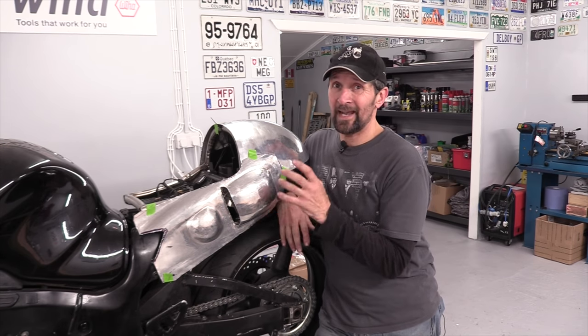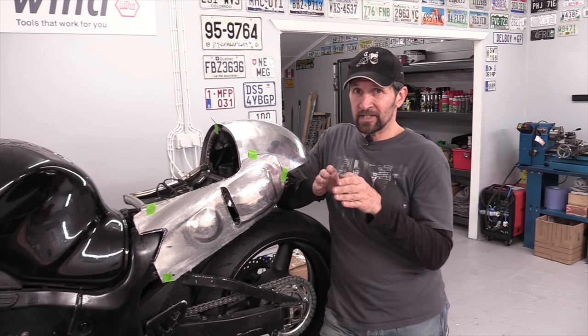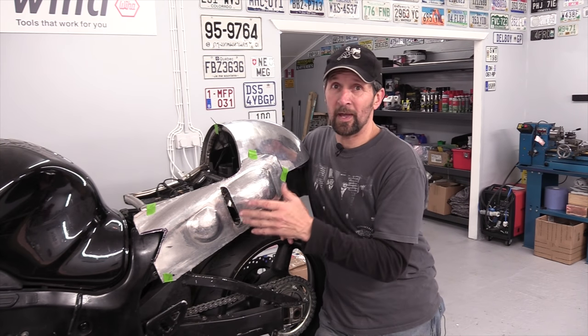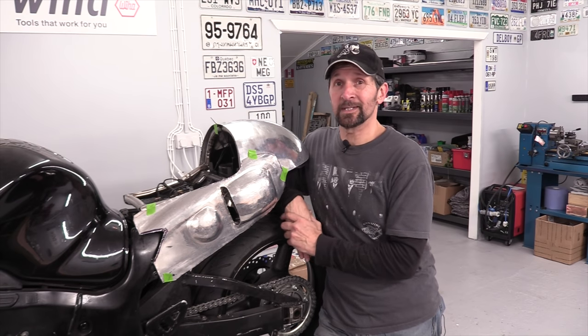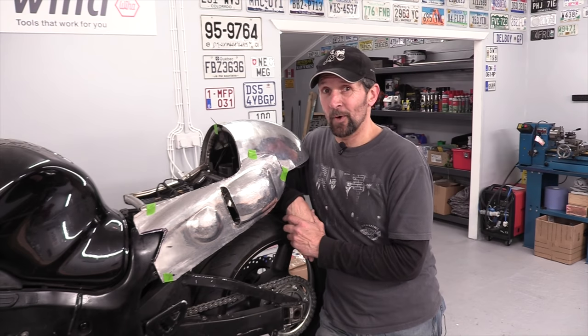But today has taught me how to make these pockets, how to stretch them, how to put creases in them, stretching stuff 2 different directions by turning the panel over in the wheel. Honestly, practice panels are priceless. You learn so much from them. This 8 hours today has been 8 hours well spent. It truly has. But there it is. Can't do anymore. So join us in the next one.